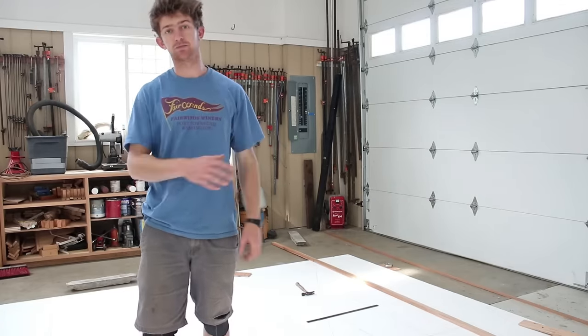So there are six diagonals on this drawing at the moment, but I've noticed there's an area right here. There's quite a big space without a diagonal, and there's also no point of data from a waterline or from a buttock line. And this is quite a critical area in the curve because it's so subtle and it's almost flat. So I'm going to add in an extra diagonal here. So all I'm going to do is just measure carefully where I put it and choose it somewhere where it can easily be transferred onto the lofting floor.